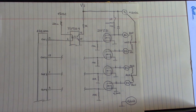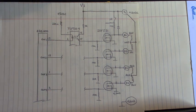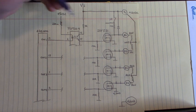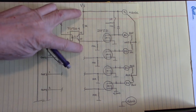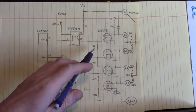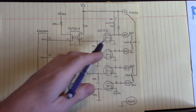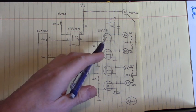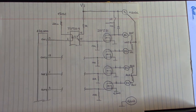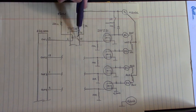The purpose of the 10 kilohm resistor is that when the output of the TLP 521-4 optocoupler is turned off and we're not in saturation, that ensures the gate is at 0 volts and turned off through the 10 kilohm resistor to VS ground.